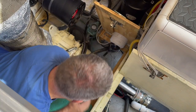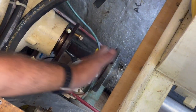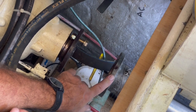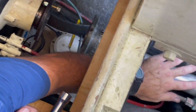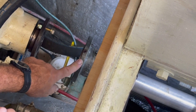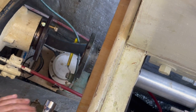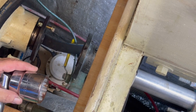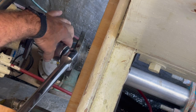It was pretty difficult getting the shaft back. I don't know if it was some growth in the cutlass bearing or if there was just a bit of crud in the stuffing box preventing it. Usually it slides back hard but not super difficult — this one was quite a bit more difficult. I needed to move it back far enough to get this 1-11/16 inch socket in there, and now I have enough room.